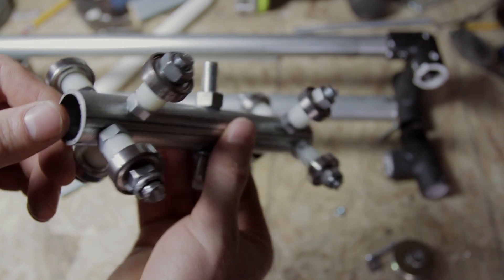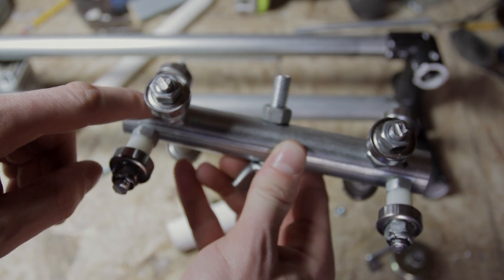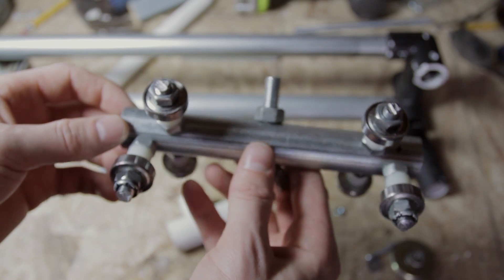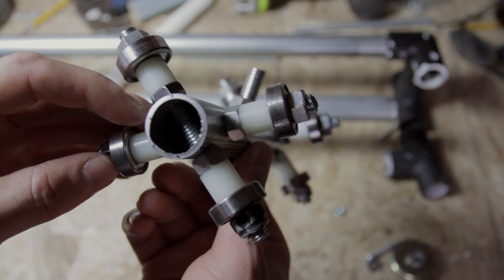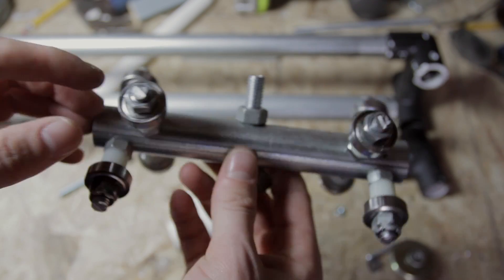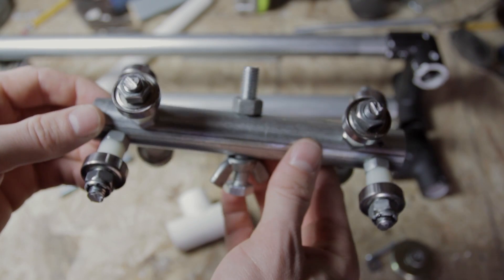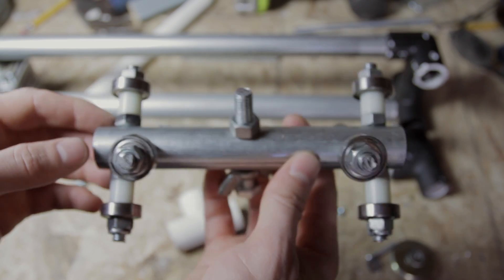This design was really pretty simple to make. It's just really important that you get the holes drilled through straight, so using a drill press really helps if you have that available to you. If not, you can try to do it with a drill, but I'd recommend using a drill press, because if you don't have something lined up right, your dolly is going to be not square. When you put it on the railing, you're going to have some wobble, and you don't want any wobble when you're sliding it back and forth along the rail.